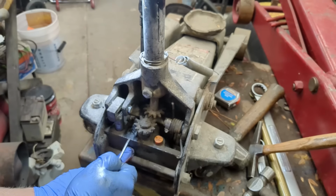And this right here is something you won't see on a jack unless you have the speed lift. This right here is a spring mechanism. I'll take it out. But essentially, I don't know if you guys can see in there. Let me get a light. You see that in the middle of the small tube, you see that shiny little rod? That is that piece right there. And then you see, so that is the hole for the center. And it just switches to that hole at the very top of the bigger cylinder. So right at the corner of the light right there, goes from here up to there. That's how it switches from the small cylinder to the big cylinder. This big hole over on the right hand side right here is just your drain back.